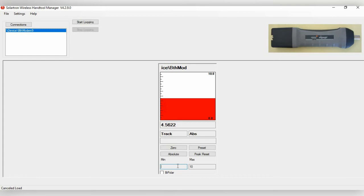Adjust the screen range from 9 to 11, since we are measuring a hole that is 10mm in diameter. Place the mastering piece on and click Preset — we are now at 10 millimeters. With the logging function set up, click Start Logging and take measurements. A button beep indicates readings within specification. A measurement at the warning limit will also be heard, and a change in tone indicates an out-of-tolerance reading.